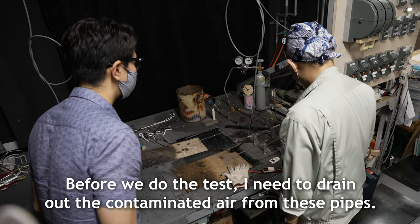And the very final step is called blocking out. Dense black paint is used to mask areas of the tube that shouldn't be illuminated according to the design. This gives neon signs the appearance that sections of the tube are seemingly floating in midair.